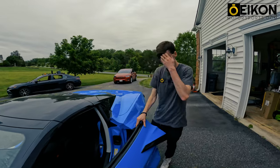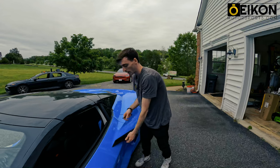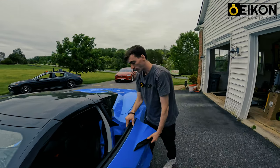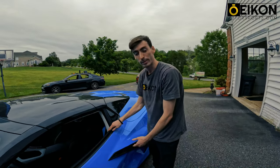When you open the door you just want to make sure that when you're shutting it, you can apply a little bit of pressure. If when you close it there's a bit of a catch, the door is probably a little bit too low. If you close it and it's clicking a little high and you don't feel too much of a bounce at the top, it might be a little bit too high.